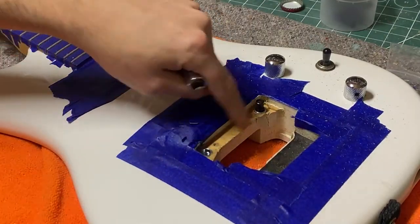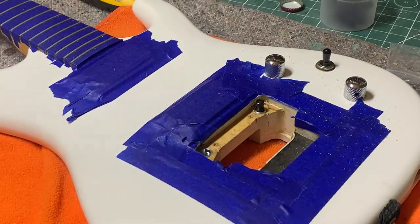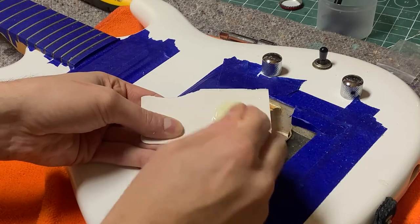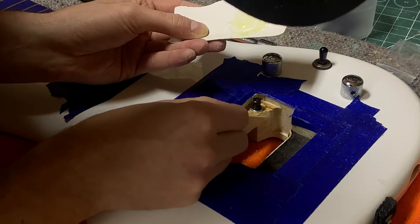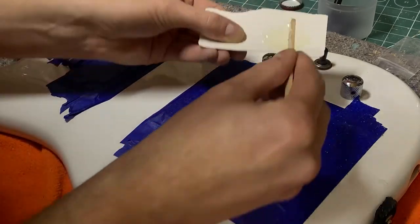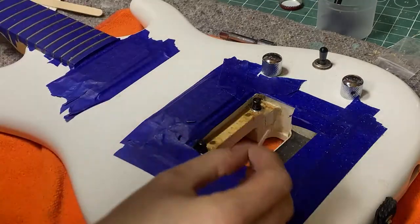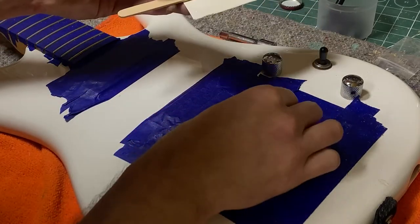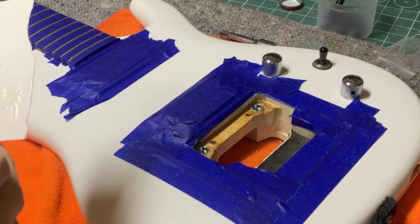Just make sure they're sitting at the same level so we've got the same height — perfect. Some two-part resin here, I'm just going to mix that up. We're going to spoon that into those gaps and hopefully it should make it rock solid. I'm also going to fill these little holes here with the screws from the previous metal brace. Take a matchstick and just work that in. All those little gaps that are peeling away I'm just going to frame this in there. It's not the prettiest repair in the world but you're not going to see it again, are we?